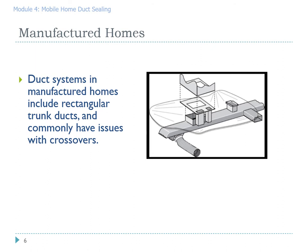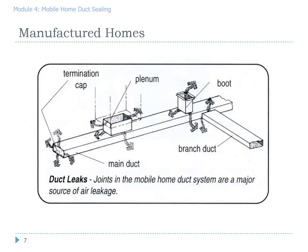Occasionally you'll see interior ducts that run to a register offset from the main plenum. Here we see a crossover going from side A to side B. The furnace would sit right here, here is the furnace to plenum connection, and occasionally there are branch ducts, but not very often. These end caps can often be non-existent, rolled up like toothpaste, or otherwise put together in a very leaky fashion. We'll show you later how to make an end cap to terminate that leakage.